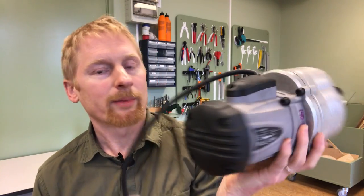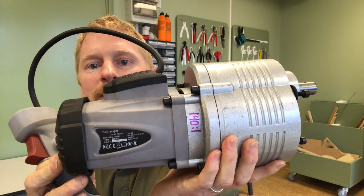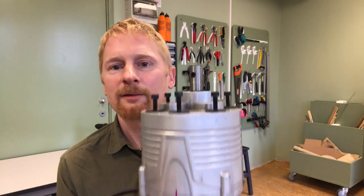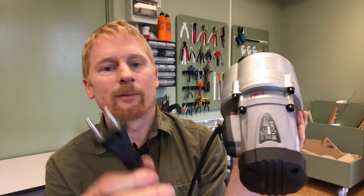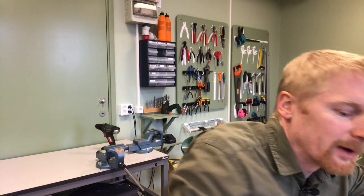Earth drills are typically gasoline powered but there are electric versions as well. This one has a series wound electric motor geared down 1:140, about two horsepower, with a very slow moving output shaft. I'd like to use this as a very powerful servo motor — like a radio control servo — and for that I need to change the direction of rotation just by switching the polarity. Since it's a series wound motor, that won't work, but with a permanent magnet motor it would.